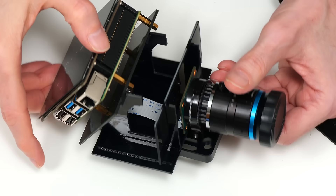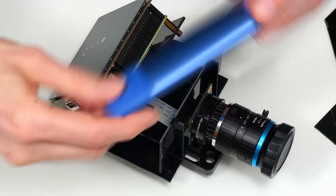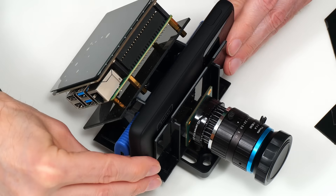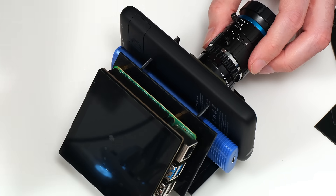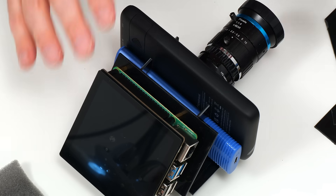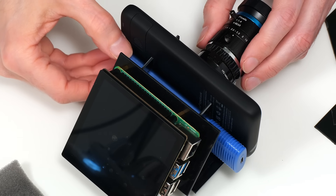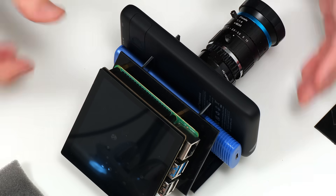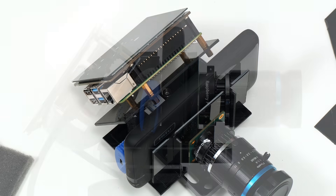The cavity in the middle of the rig is where the SSD mounts in, and the power bank battery mounts in as well. Some packing foam will hold everything snugly when finally assembled. It's also worth pointing out that in further tests I discovered the SSD wasn't being recognized by CinePi because it was formatted exFAT. I've now reformatted it as NTFS and everything is working fine. So it's time to put this on a tripod with the associated power and data leads.